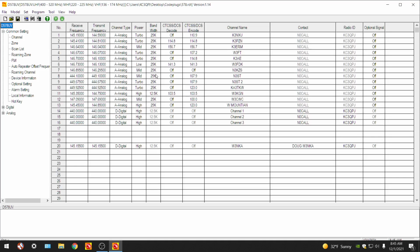However, once you're into the software, whatever your last code plug was that you were working on will pop up on the screen. All your channels will be here. I have a lot of my channels spread out, so that when I'm creating different zones or I want to create a new channel, they don't really bleed over into each other. So you don't want to have an analog channel here, a digital channel here, and then another analog channel, or even a simplex thrown in. But there are some modifications that I do need to make to my software.